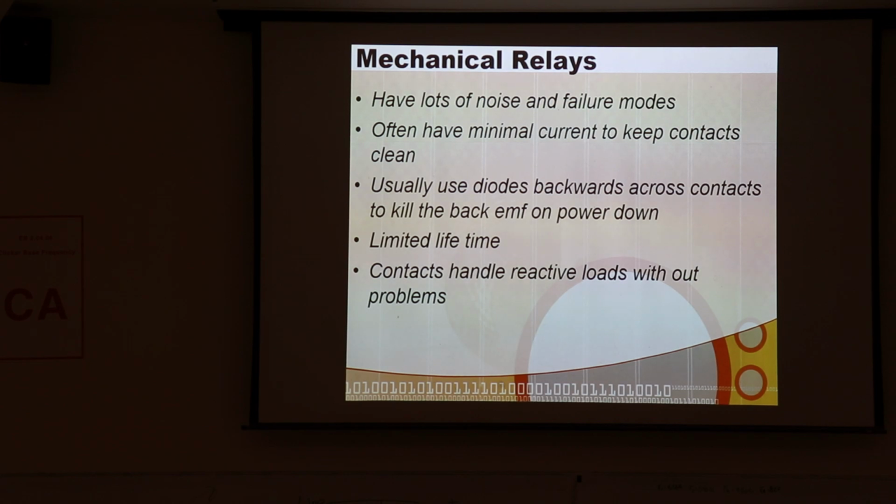Now, there are a myriad of reasons why that can happen. But most of the time, not all the time, most of the time, it's because some controller board driving your operation goes out. And most likely, that controller board has about 10 relays on it. Little bitty, tiny relays, and one of them stopped working. That is like the overwhelming most likely reason. I mean, your compressor can fail, you can run out of Freon, there are a lot of things, but normally there's a lot of failure with mechanical relays.